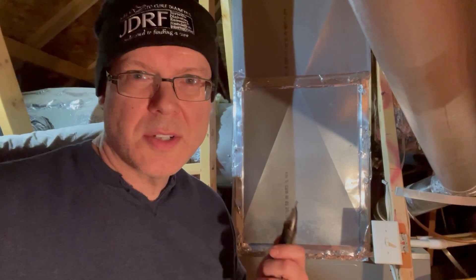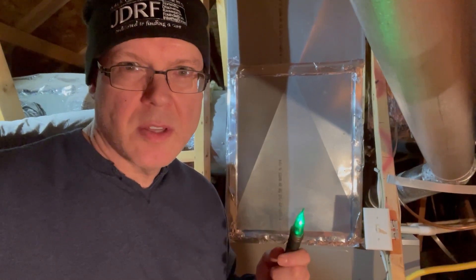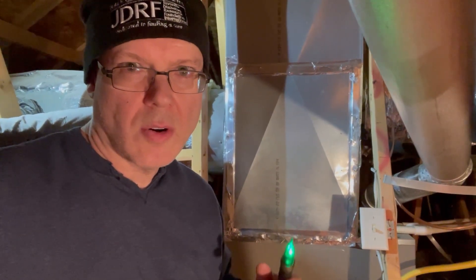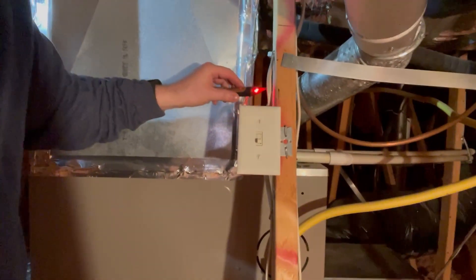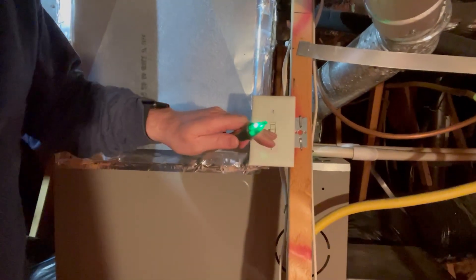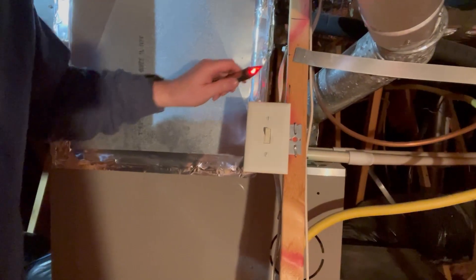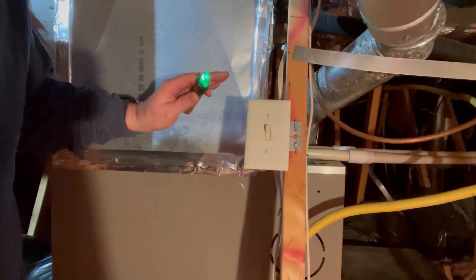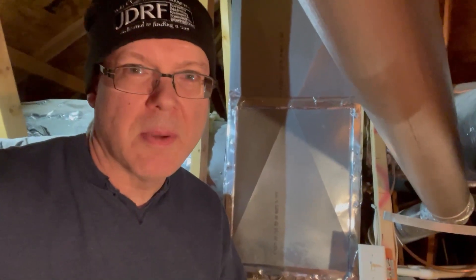Back up in the attic — getting a little bit of a workout today. I'm going to do what I always do: turn on power from the panel, check the AC voltage, make sure there's power coming into the switch, make sure the switch isn't shorting across and delivering power through, make sure off really means off. Got my power coming in. Come down to the bottom — no power coming out. Good sign. Going to turn it on. Power coming in, no shorts causing anything to trip at the circuit breaker, and power coming out. Feeling pretty good. Hopefully this is the only problem — it was just a switch. That switch has been there for over 20 years, so not surprising that it broke.